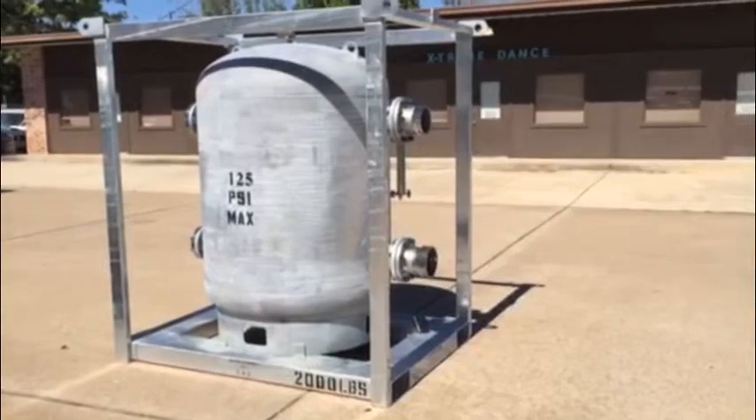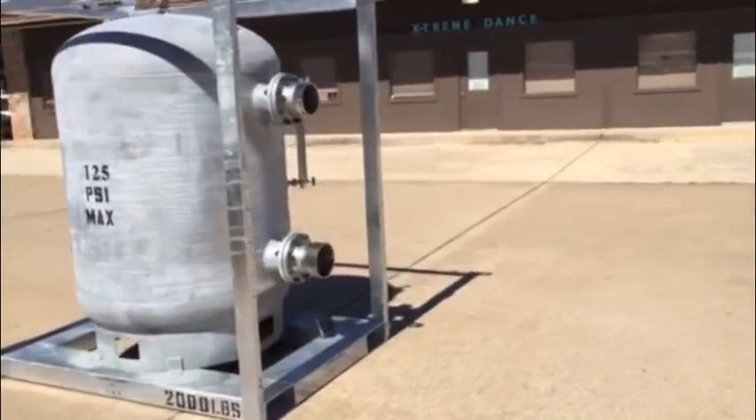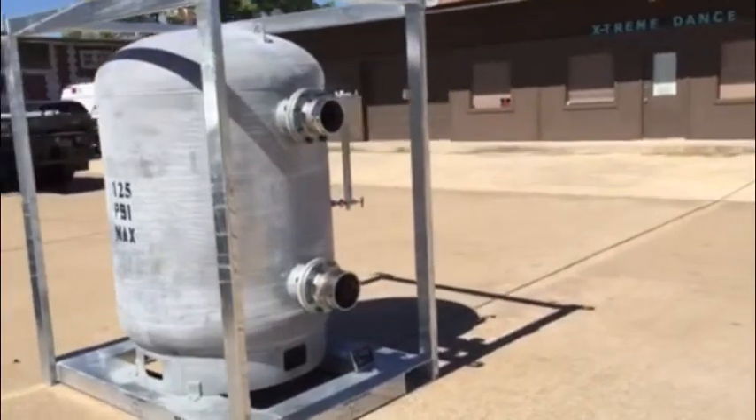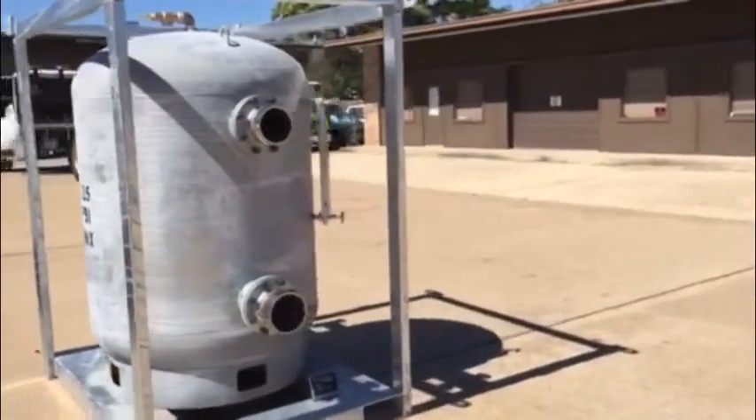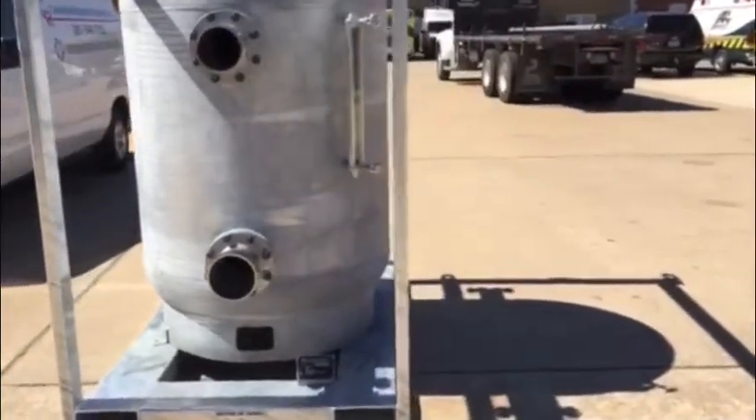do both a 200-ton all the way down to a 20-ton chiller. You'll see it has both four and six inch connections, an armored sight glass. It is an ASME tank with an installed PRV.